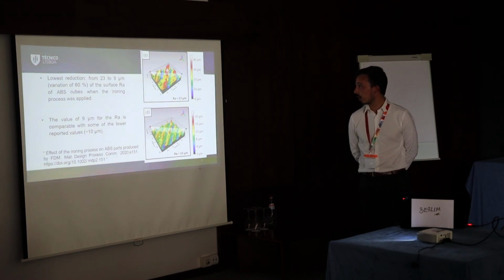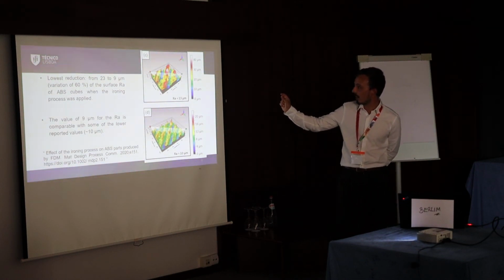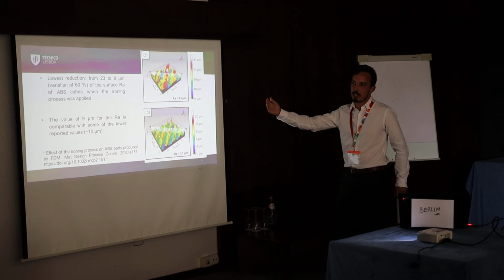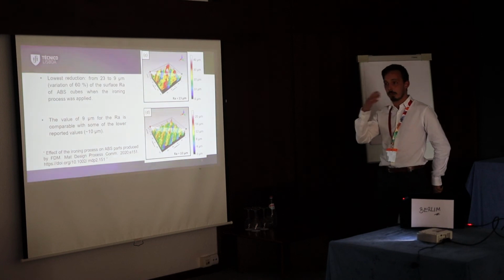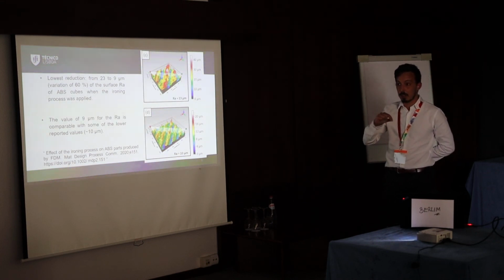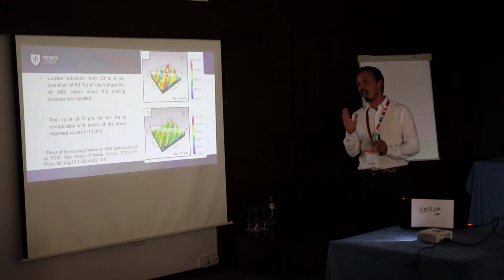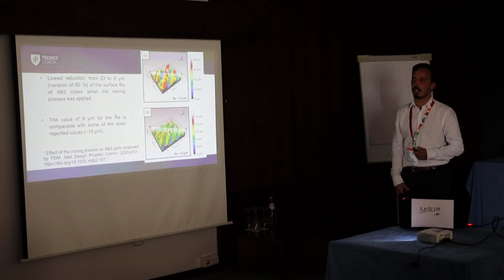So this is a non-ironed top layer, okay, even though this is a very, very small section, you cannot see it, but it's 200 microns. We did multiple sections of a 10 by 10 by 10 millimeter cube, applying ironing with multiple strategies, and you clearly see a reduction in surface roughness all across the specimen, except for the outer perimeter, where it's very difficult to be exactly aligned with the normal contour of a part. This is the most tricky part of this process, I guess.